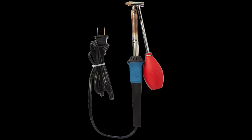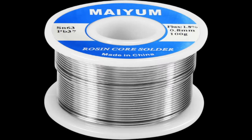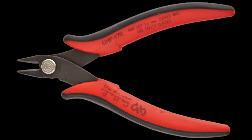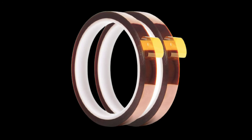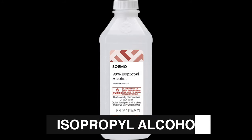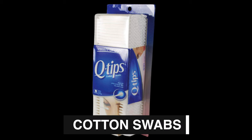Get something respectable like this temperature adjustable soldering iron kit. You'll also need a desoldering iron for correcting occasional mistakes or removing components. You'll need rosin core solder, which already has the flux mixed in with the solder wire. You'll need a small set of flush cutters to trim component leads, and I'd highly recommend a small roll of Kapton tape — it's highly heat resistant and helps hold components in place so you don't burn your hands. For cleanup, you'll need 99% isopropyl alcohol and cotton swabs.